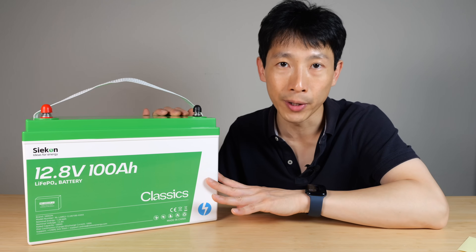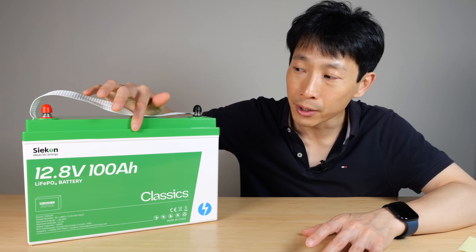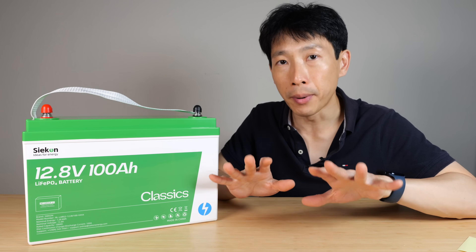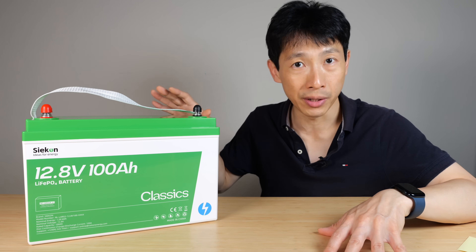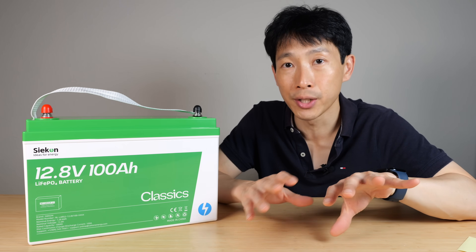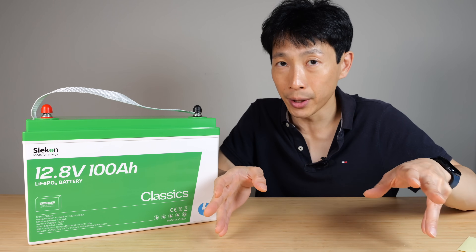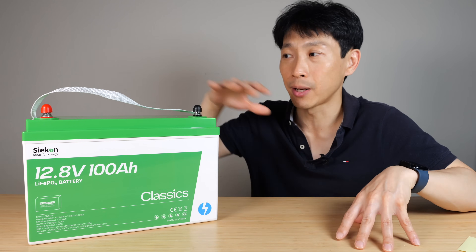You might be tempted to buy four of these and make a 48 volt battery, but in my experience I had the bigger 200 amp hour 12 volt batteries, put two of them in series, and made a 24 volt system. I started with both batteries at equal voltage but after a couple of months they differed by about 0.3 volts. This is pretty significant — if one cell is lower in voltage than another and you treat the entire pack as equalized, you could potentially overcharge one cell or over-discharge another.